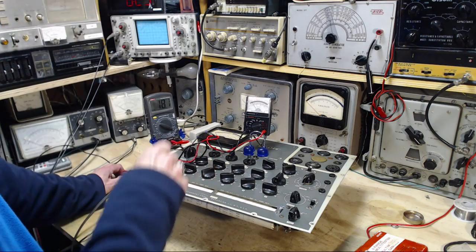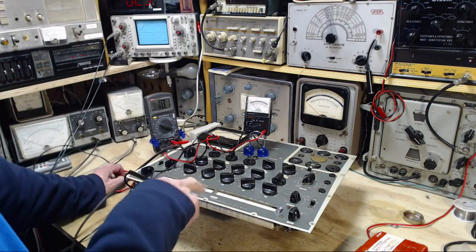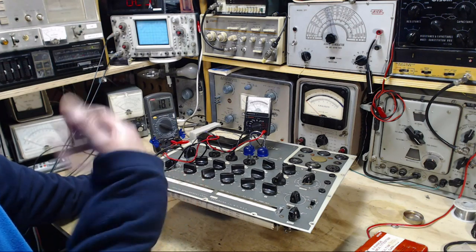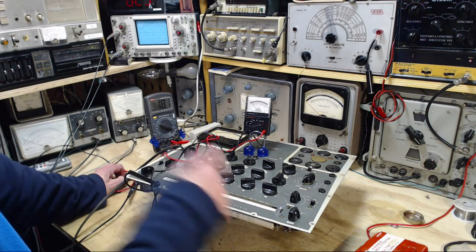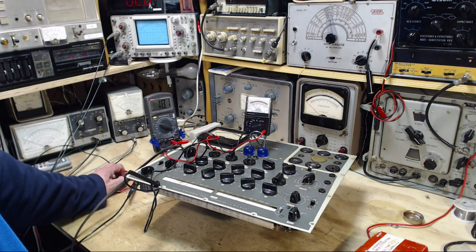So this tells me the voltage that's getting onto here is coming through a high impedance circuit of some sort. What that tells me, and this is what I really have been after, is: is it safe to put a three-wire, three-prong plug on this and connect the ground wire to the chassis? Or will I be setting up a scenario where I'm shorting out the power line? Well, I plug it in, boom. And the answer is no.